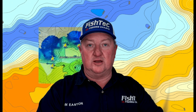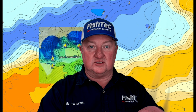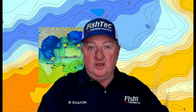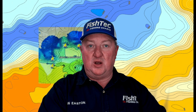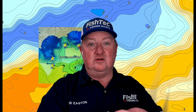So when you go online to buy a chart, go and see what the star rating is, and based on those stars you'll see roughly what the interpolation is. All my new charts going forward, as of the end of 2023, beginning of 2024 and throughout this year, I use 5-star. 30 meter interpolation is my absolute maximum. If I don't have data to fill in at 30 meter interpolation, I leave it out, because the minute I start increasing that interpolation, we start getting averaging, AI, artificial intelligence. So just keep an eye out for the quality of your charts from that perspective.